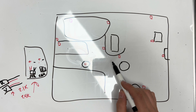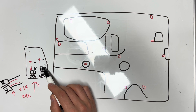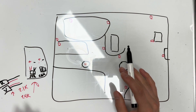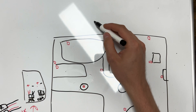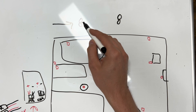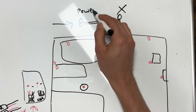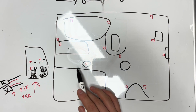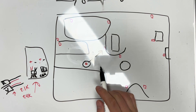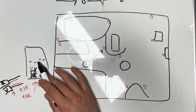We hooked the wires back to the chime and put it back together. When you break the device apart and take the wires off the positive and negative, it kills the rest of the line — similar to receptacles. If you have a home run with a first receptacle and a second one daisy-chained, disconnecting the wires to the first means the second won't work. Same idea here: if you disconnect the outgoing wires to the next box, you'll have no signal past that point.